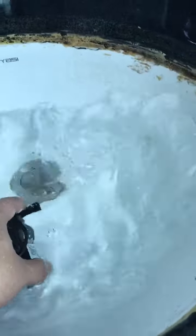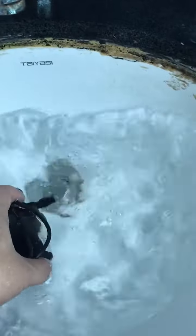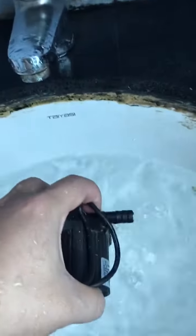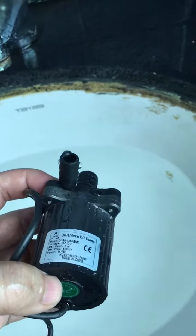As you can see, its pressure is good and the flow rate is considerably good too. However, this pump cannot self-prime and it cannot dry run for a long time. Dry running is damaging to this pump — sharp noise will exist.